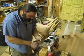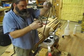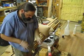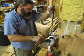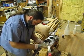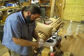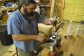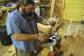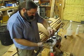You'll see that your carbon wants to unwind on you a little bit. Just break it off. It's just a little string that weaves it together. Doesn't matter what direction you go. If you go towards the top or bottom first, just put it under evenly and build it up evenly, just like you're winding rope onto a spool. You want to make sure you run it tight up into the shoulders of your sanded sleeve. You don't want any gaps anywhere in there.